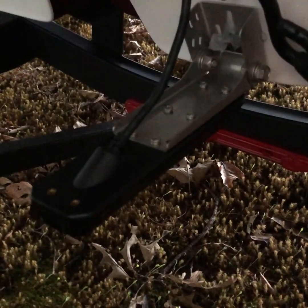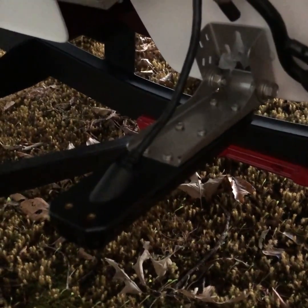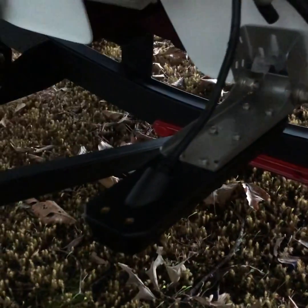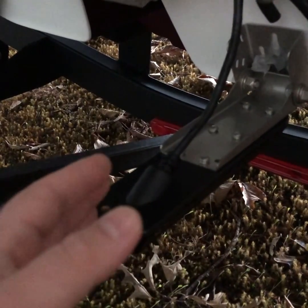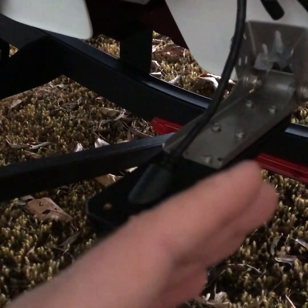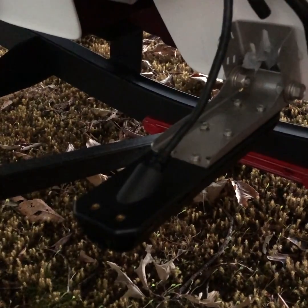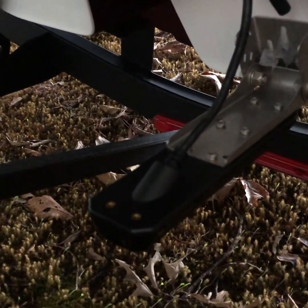Okay guys, so starting with the transducer, what you want to do is figure out, do I fish with people or do I fish by myself? The number one reason is if you fish by yourself, you need to make this side of the transducer, which is on the driver's side, just a tad bit higher. Then, while you're out on the water, get a 4-foot level, put it on the front of your boat, and when you're idling around at whatever speed you're used to graphing at, you're going to adjust that level. Easiest way to do it is put quarters under it.